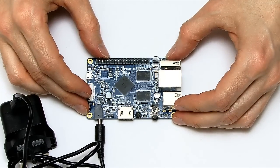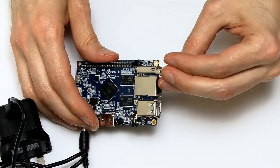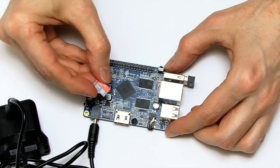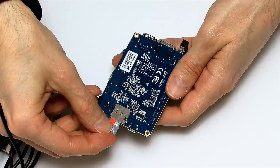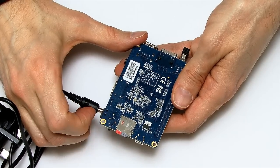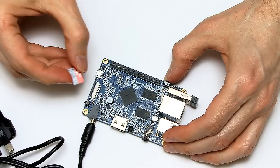What else will we need? Since there isn't Wi-Fi on this board, we're going to use a Wi-Fi dongle, which I'll plug into the USB socket. And of course we'll also need a micro SD card — I'll use a SanDisk card, which plugs in underneath. It's a nice push-in push-out connector, just like you don't have on the Raspberry Pi 3. I'll take that out now and go in search of some operating systems for our Orange Pi PC.